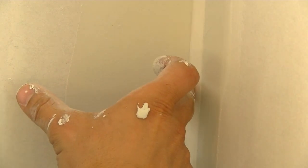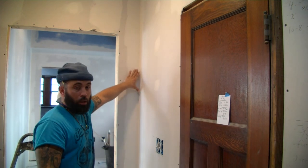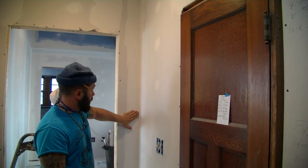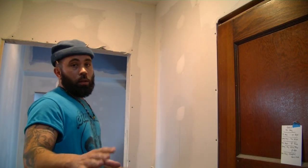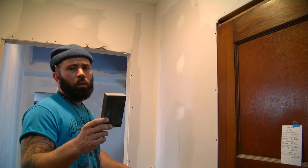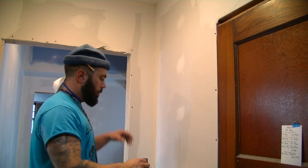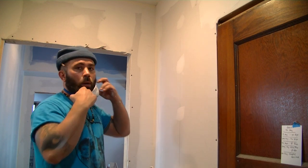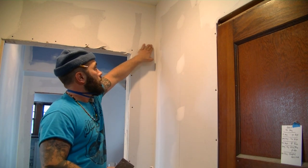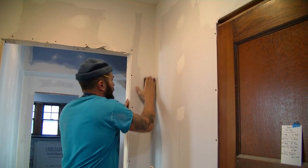What matters above all else is that from the corner where the paper meets, you have about an eighth of an inch covering the paper and this line right here is tight. You might have a little bit of slop on the opposing wall but that's not a big deal. This one I did yesterday for demonstration purposes — this side is nice and dry, this side I can still see the paper tape. I'm going to sand this in real time. They sell pole sanders and palm sanders but just use a sponge — a simple, humble four-dollar drywall sponge. I'll do this whole house with this one four-dollar sponge. When you're sanding you're not sanding it off, you're shaping it — taking off little chips — and you don't want to expose that paper.